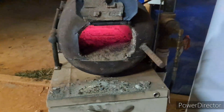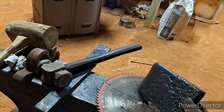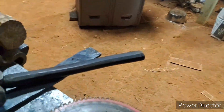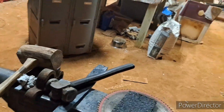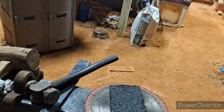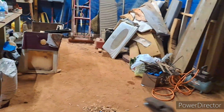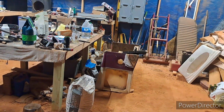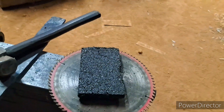She started melting in the back and some of it stuck in my forge back there, but it'll be all right. So it started melting. Sodium bentonite clay melts at 2,100 degrees, and coal slag melts at 2,300 degrees. So we don't have like a 3,000-degree refractory right here. I poured it to it and there was nothing in there to suck heat off of it — it was catching it all. The refractory in there is Mizzou — it's a 3,000-degree refractory. So I think I can use this in the furnace for refractory. I think I can honestly take that Portland and make a very light insulative layer — probably inch and a half, two inches — and then make some of this as a fire face. And I think it'll be okay. If not, I'm not out of a whole lot of money. So I think we're going to go with it.